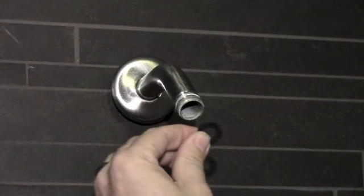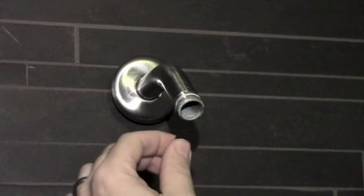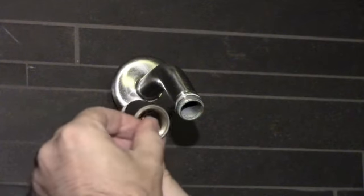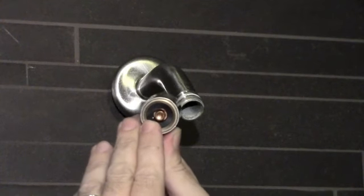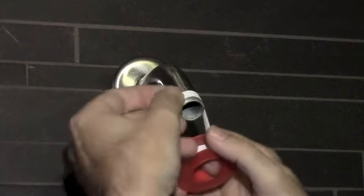When we install the shower start valve, we do not use rubber O-rings or rubber washers — rather, we use Teflon tape. You want to make sure that washer is gone because, as you can see, this ring is a perfect fit for the back of this valve. If it's not removed, you'll block up the valve and you won't get normal flow. We use PTFE, or what's commonly known as plumber's tape.